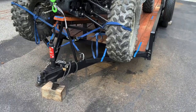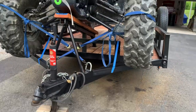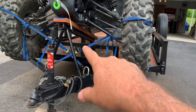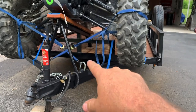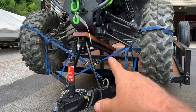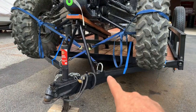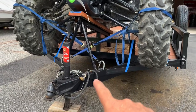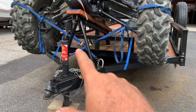Well, here's the update, guys. Here's a convertible 20-footer. See, I notched out. I dropped the front rail. You see how high it used to be. In the middle, I dropped it, notched it out, saw the tire come through, made me a frame for the ramp, added some extra right here to hold the tire up so the suspension wouldn't droop, added me some anchor points,